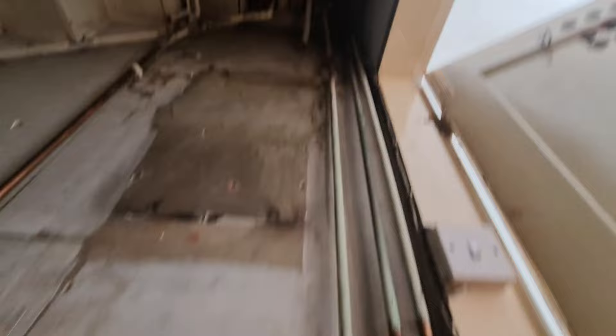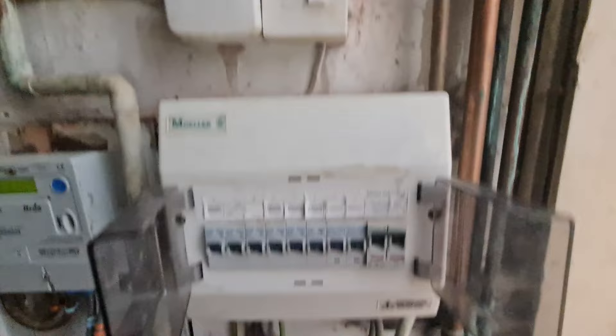We do have these cut ends. I think this cut end here runs straight up and into the tank cupboard for that other cut end - it probably used to go into the spare and run off and power what would have been a wiring centre up in that boiler cabinet. That's what my spider senses are telling me. Let's open this up, do some dead tests, and see what we've got on which circuit.